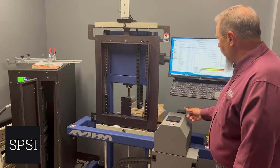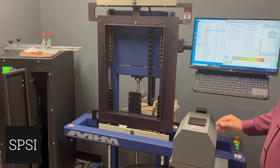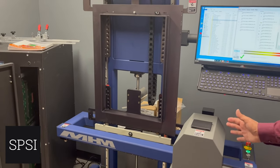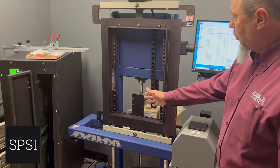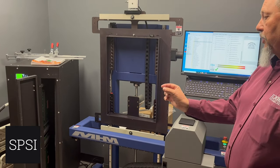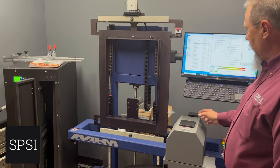Another big difference is the Spider 3 has an XYZ movement. There's a laser inside the printhead mechanism — the first thing the machine does when the printhead comes across is it shoots the laser to the surface of the screen and automatically adjusts the printhead distance between the screen and the printhead.